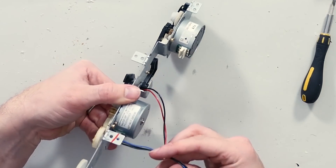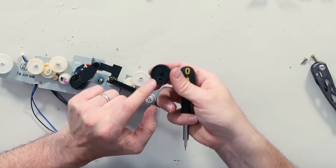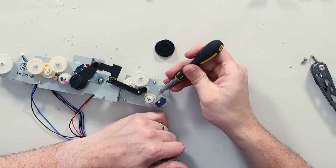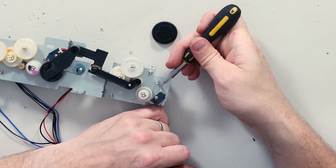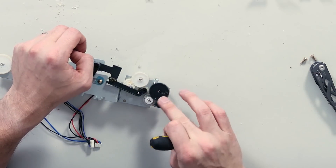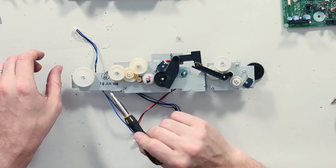Here are the paper feed electronics. We've got two motors. On the underside of this cog, not only has it got the asymmetric connection for that cam and push rod, but it's also got this cam built into the back. As it rotated to a very particular position, this micro switch was activated. It would also only turn in one direction — which makes it an interesting choice to use a stepper motor. If you know rotationally exactly where you are every revolution, I don't really see the need for a stepper motor. You could have done that with a straight DC motor.